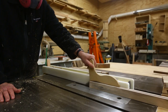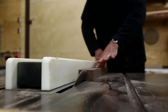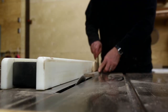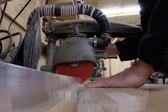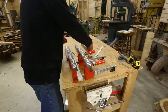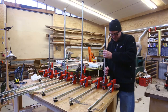My idea was to do a pattern with the maple inside the walnut. I've been wanting to make a pattern where you make one part and just by flipping that piece around you can make a bigger part of the pattern. I cut an angle through the walnut and inserted a maple strip in that cut at an angle, working toward making a chevron pattern. I slipped a piece of maple between the two pieces of walnut, got everything cut to length, and glued the three pieces together. Clamping required two clamps parallel to the glue joint and one perpendicular to keep the pieces from sliding as they met at an angle.